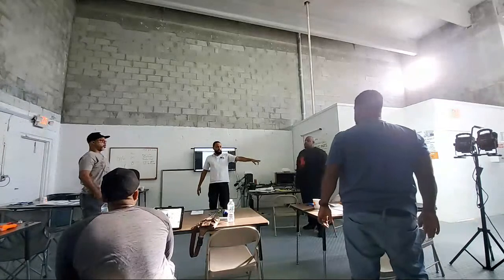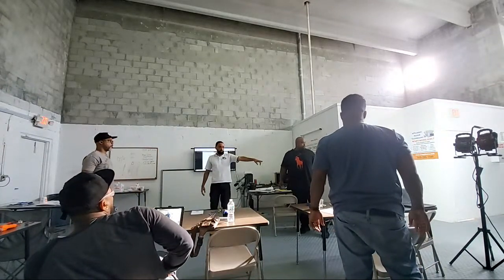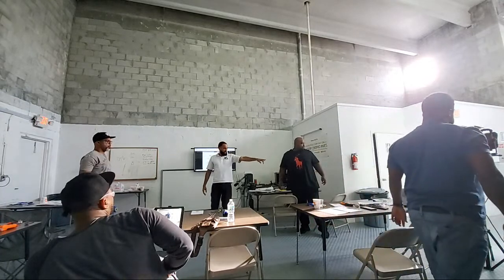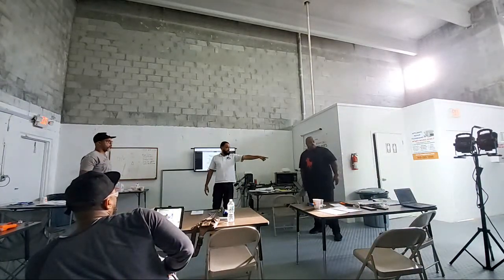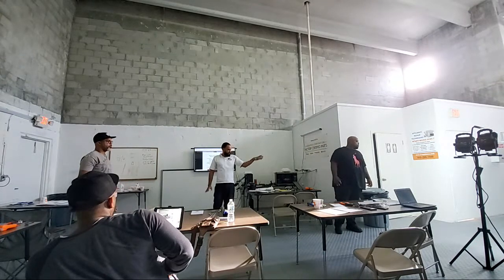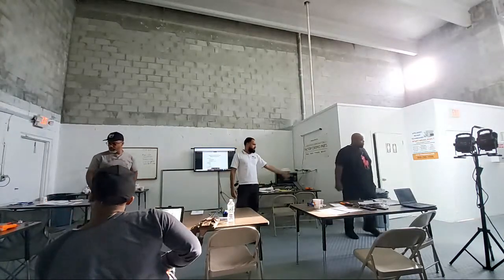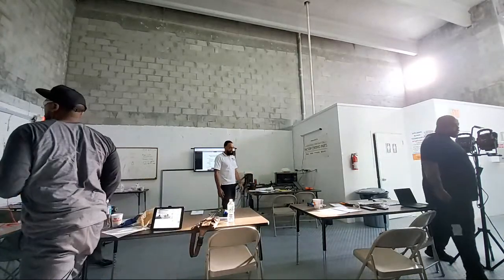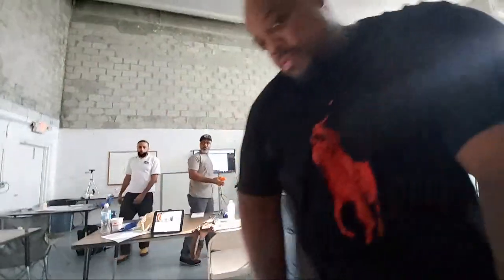I want you to disconnect the condenser fan and measure voltage. That may be DC, that may be AC. I want you to tell me. If you don't know, no problem, but try to figure it out and see if you have an AC or DC fan. Let's learn how to measure voltage at that condenser, and then we're going to do it on the inside at the evaporator.